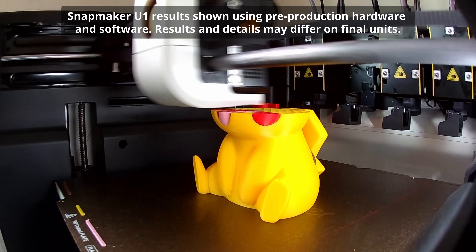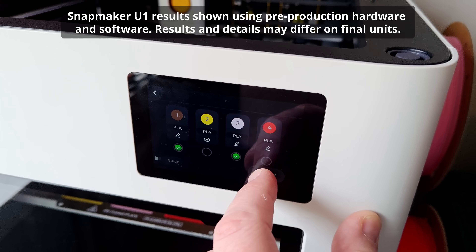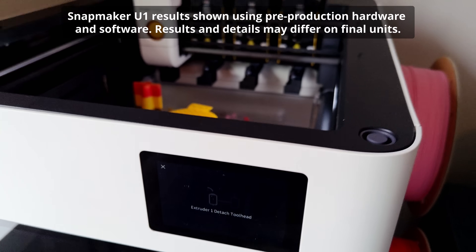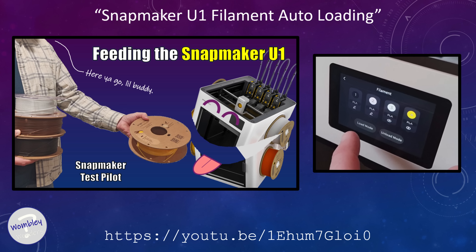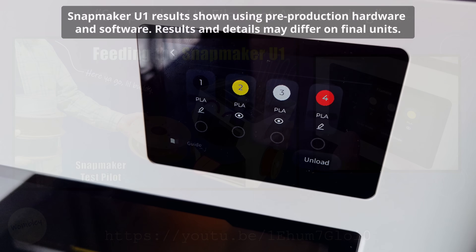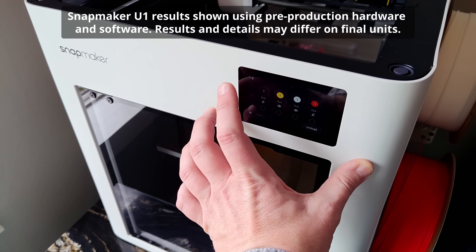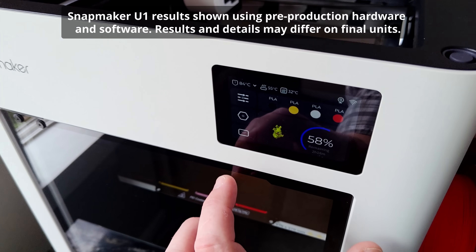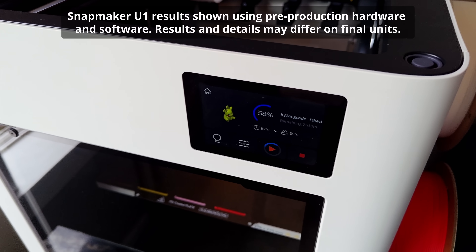Once that pause hits, you're just dumped on the screen. So I drill down to the filament menu and tell it to unload those two filaments. I did a whole video about this, but there is automatic loading and unloading for this printer. You just tell it which tools to load and unload — I'll put a link below. And here we are with our new filaments loaded. Go back to the home screen, tap on the printing menu, and hit play so that it resumes.